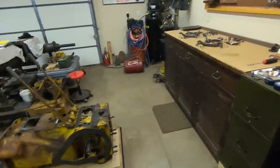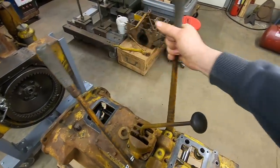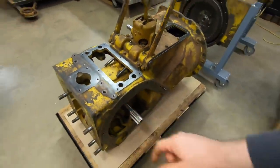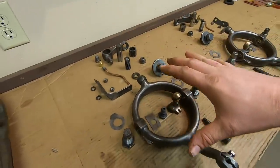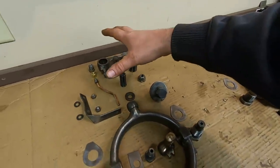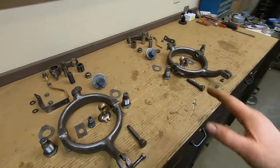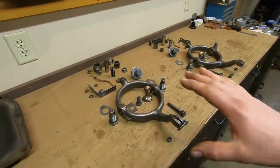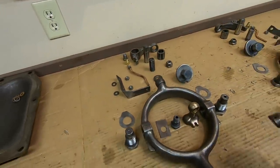We can begin — steering clutch time on 1113. I want to attach these levers to something so we can put a whole bunch of pieces into the back area of this case. You can see I've already invested some time cleaning and prepping the already loose components. These weren't anything disassembled off-camera — this is all stuff taken apart during the teardown phase. I have two batches separated: left side and right side components. I like to keep them matched because you have wear patterns from pieces that have contacted.